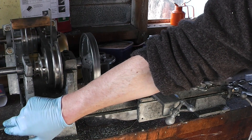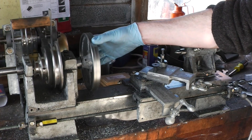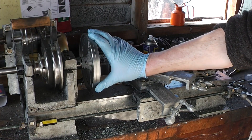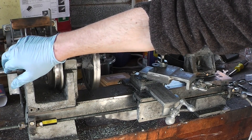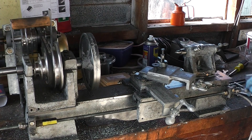I still have to make the pulleys on here, which will mean that for every revolution the headstock spindle makes, once I've got the pulleys in, it'll automatically turn this screw — one-sixteenth of a revolution every time the spindle turns, so as the spindle turns it'll automatically travel down. I haven't done that yet because I still have to locate the right size pulleys.